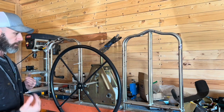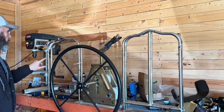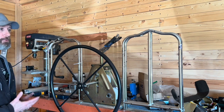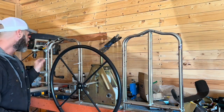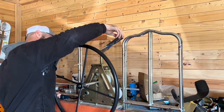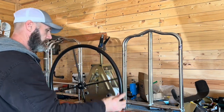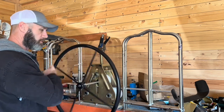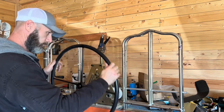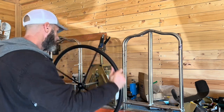You tape down the cardboard, mount something to the center, and make a diameter the length of the hoop you're creating. We're looking for a 56-inch hoop. I have 53 marked on here, so we're going to go just underneath that, then stop and compare it to another paramotor I have. If you have a paramotor and you're just replicating the hoop, you can compare these segments to that and mark it. There's going to be about three or four inches at each end that don't roll out. Roll this down just a little bit each segment — you don't want to do too much at a time.